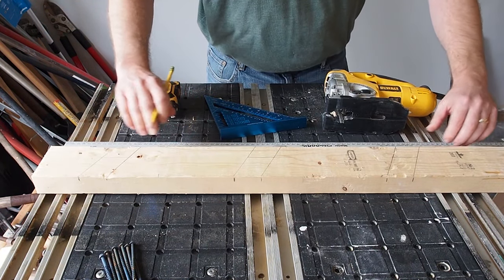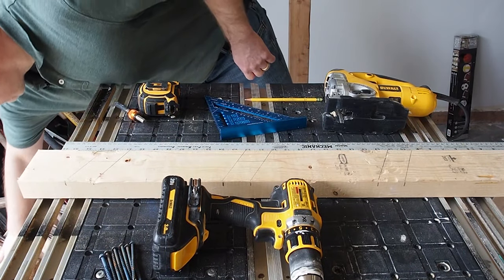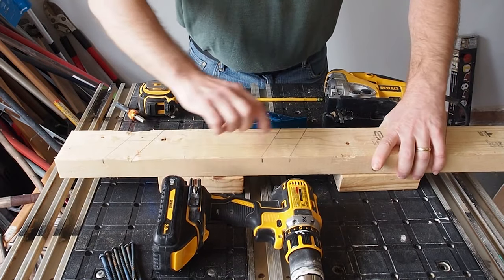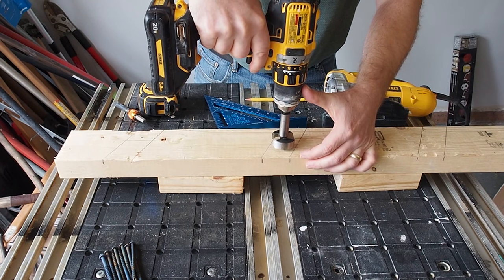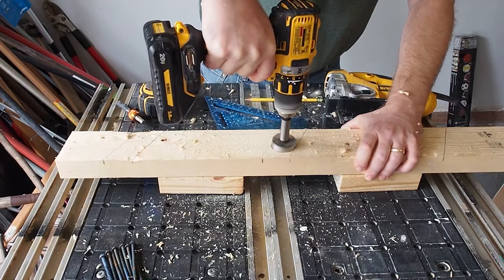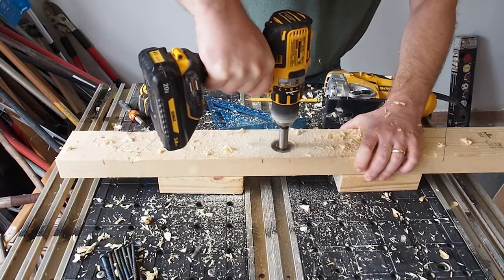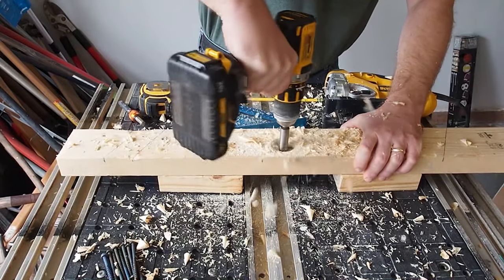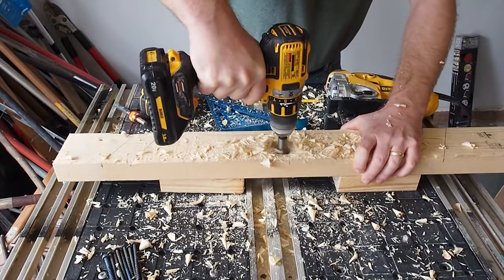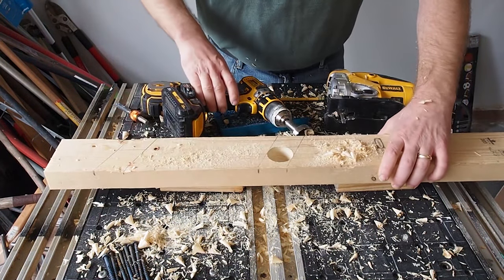We try to keep it simple — you can use basic hand tools. I'm going to use a drill in this case. I've got a couple of blocks to demonstrate how to do the first one. I'm going to take the Forstner bit, line it up with the three lines right there, and start to make the cut. We've got a nice hole here, and the last thing I'm going to do is cut off these two pieces, and for that I'm going to use the jigsaw.